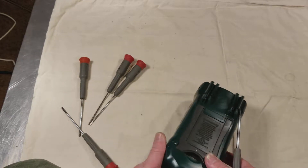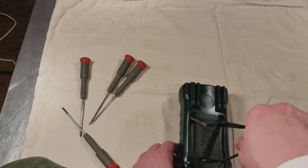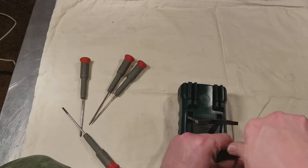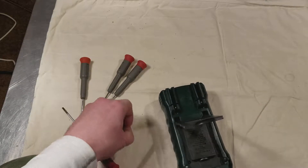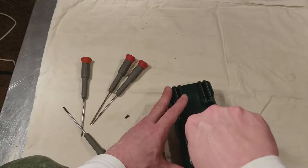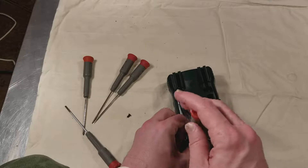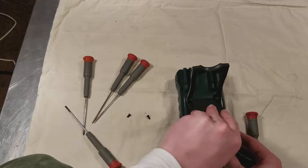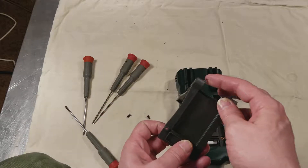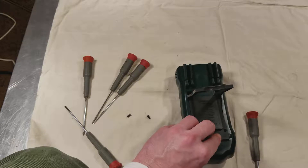These aren't bad to get into. To get into the battery cover, you make sure you unplug the probes. There's screws on each side of the battery cover, which I kind of like, because you have two screws instead of one. These screws aren't captured, so they'll fall out when you remove the battery cover, so you want to be kind of careful of that. Pull out those two screws — there's a little place to get your thumb to pop out the battery cover. It has two catches, so it kind of goes in from the top and rocks in.